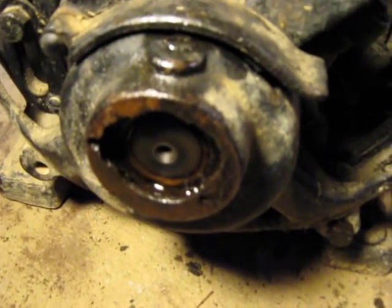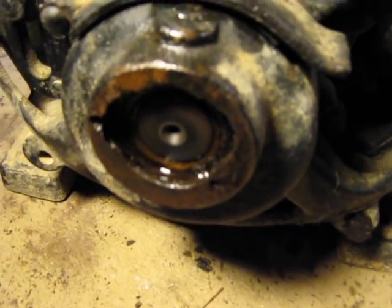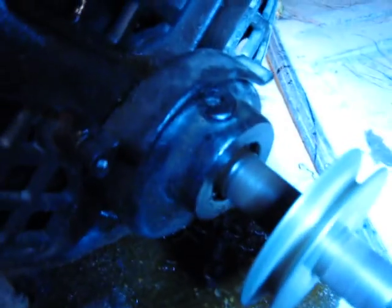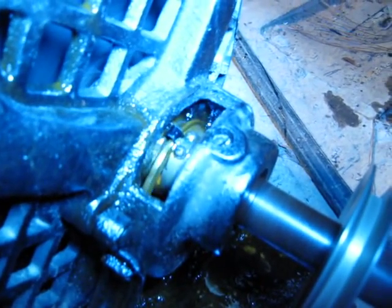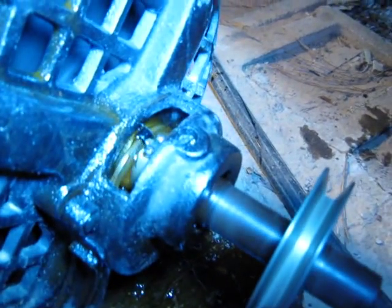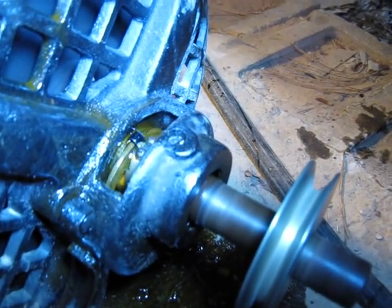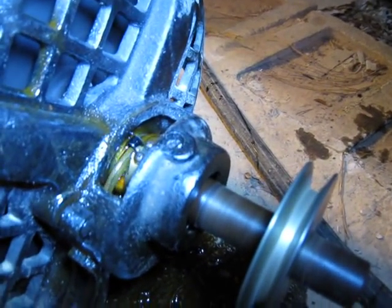You can see through the damage in the housing — a little bit of oil is coming around the shaft. The front should have some oil in there too. The bearings are made out of solid brass; there are no pores in them for oil to soak through. They need to have liquid oil pouring on them.